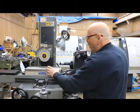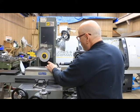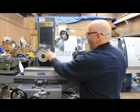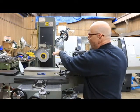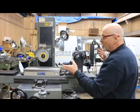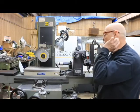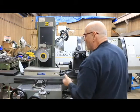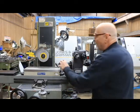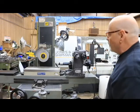You're going to have to move this all the way over. If you had a smaller magnet on here, which is what some people do, they can move this over a little further. In this case your workpiece is going to have to fall within the range that you can make this minute focus adjustment. This machine is also equipped with an opti dress, which is not here at the moment - it's being boxed up. That's going to dress a special form on the wheel. You may only be using this to check that form right on the machine as you just ground it - to dress it and then visually inspect what you just dressed. People do actually grind a workpiece and move this up and down after making little movements. It's been hit a few times - this is just a protective ring and you can purchase this new.